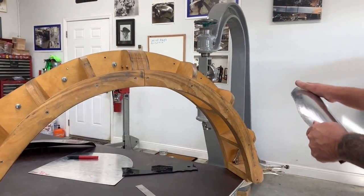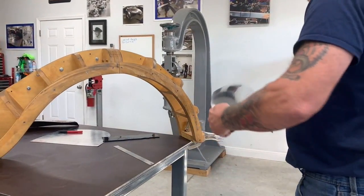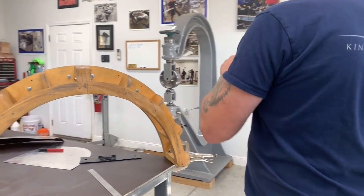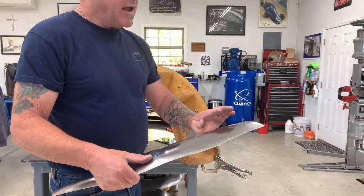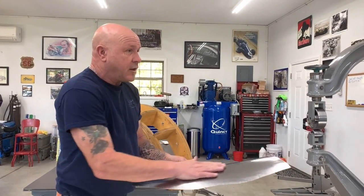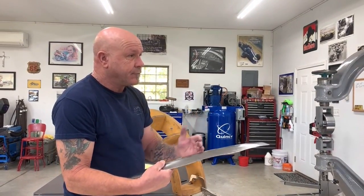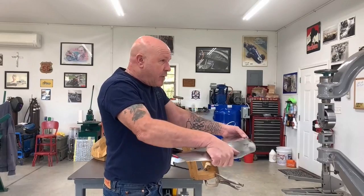And then when I feel your panel, I'm feeling that we have some inconsistencies, little highs and lows going through. So the easiest format to take care of that would be jump in the English wheel, do some crosswheeling. So then that way you'll be able to, at the same time as the wheel evens out a lot of the unevenness, and it's very slight, you'll be able to put more shape in it and still maintain the curvature that you've got. Okay. And at the same time, you'll be able to gently pull the panel over each time